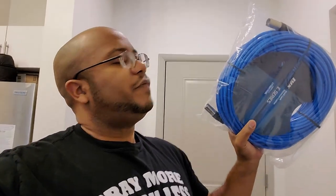I have a lot of other supplies going on. For Greater Works, I have a 150-foot EtherCon — I'm actually going to be sending audio over it to receive and send channels for the speakers and instrument plugins, so instead of running multiple XLRs we run that, terminating on a balun-type connector on either end. So at this point we're just going to run one SDI cable, two Ethernet cables, and one EtherCon cable into the ceiling. The other SDI cables throughout the church will be run on Wednesday.